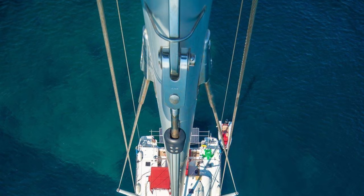Well, negatives, of course, is if you have any serious damage, then you have to make sure you get out of the water quickly to make a repair, let the wood dry out. But normally you don't get yourself into that situation where you have a hull fracture. And of course, wood would then fracture, whereas steel and aluminum would give in. But then again, fiberglass also fractures. It's not so easy to disturb it.